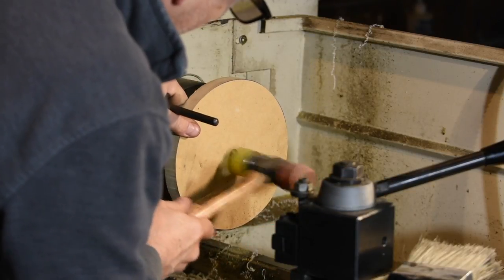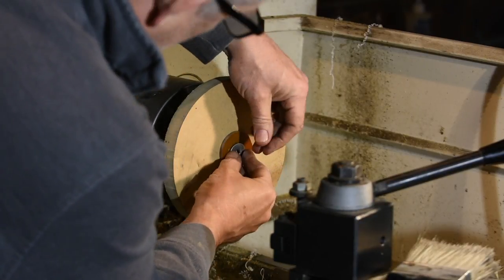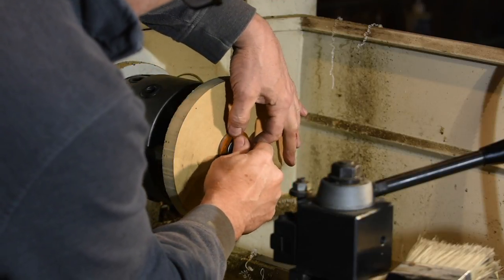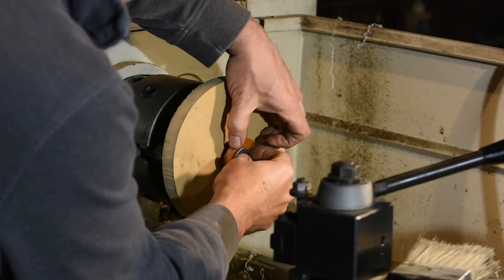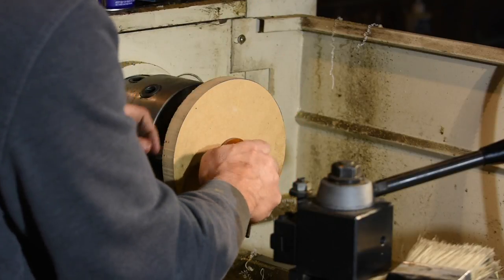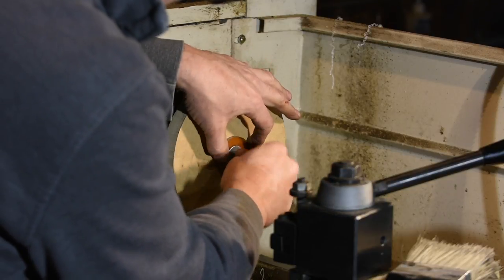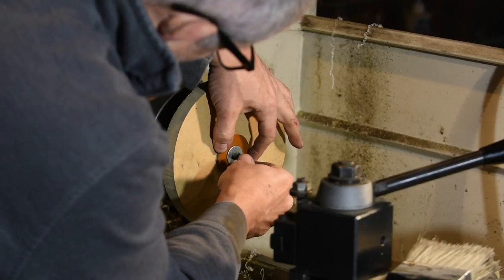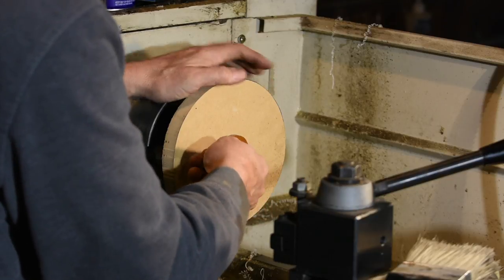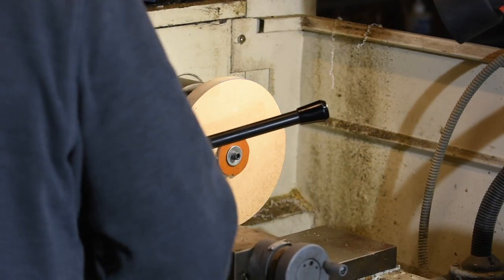The reason I'm doing it in this order — first drilling the hole, then putting it on a mandrel — is that you want this wheel to run as true as humanly possible. The less perfect the concentricity, the more it'll bump and vibrate, making the stropping process frustrating. If you turn the outside first and then drill the center hole, any minor problems with concentricity will make the wheel run out of true, which at 3,750 RPM can have some pretty unpleasant consequences.